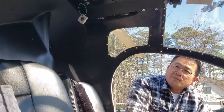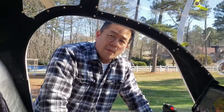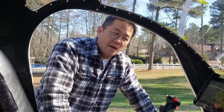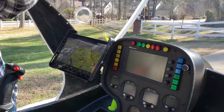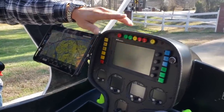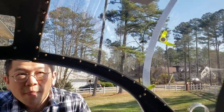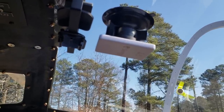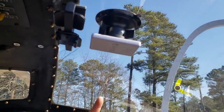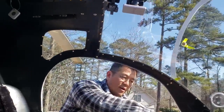This ship is 2020 ADS-B compliant. I've installed ADS-B out, so other people know where we are. And it's controlled by the glass panel — once I flip the avionics on, I can show you the ADS-B traffic. This unit picks up traffic and sends it to my iPad here showing all the traffic around us.